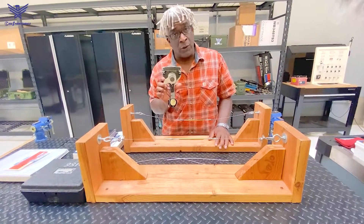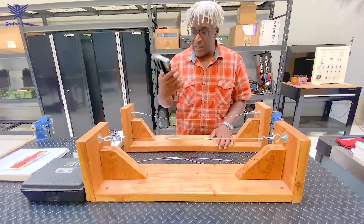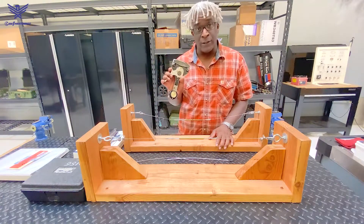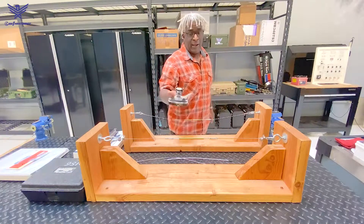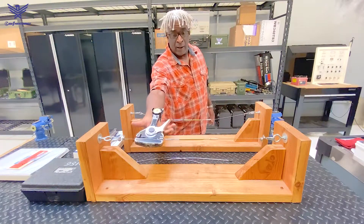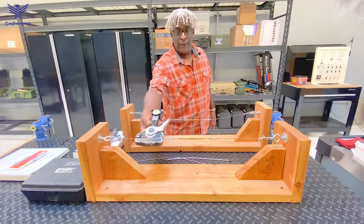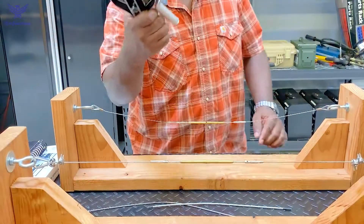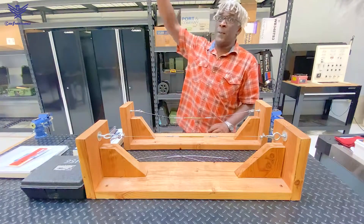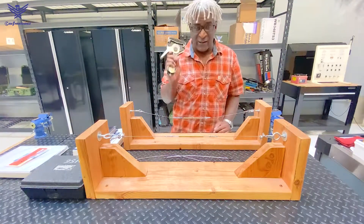One other cool feature about this tool is: what if you're in an area where you can't read the gauge? You can't put the cable on and read it. This tool has a hold function. I can go in and reach into that inaccessible area, get my reading, and use this pin to hold it, then release it. When I come back to it, the face still has the reading on it. So if I have to reach up in between other cables or through a bulkhead, I can still take a reading.